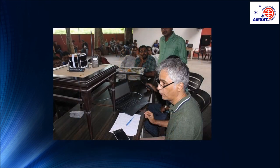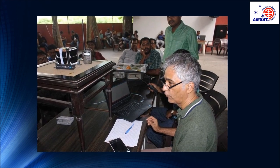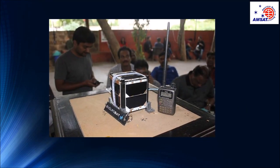It has an uplink at 435.34 MHz and a downlink at 145.9 MHz. We're trying out something a little unique this time — to open up the transponder instead of the CTCSS at 67 Hz, what you need to do is press the pound key a couple of times, as it's a little easier and better to detect DTMF. So just remember to do that when you access the satellite, and then the transponder opens for two minutes.